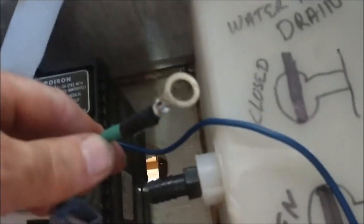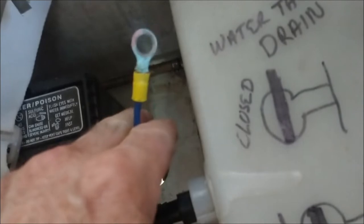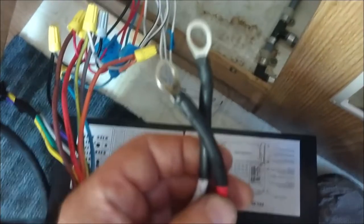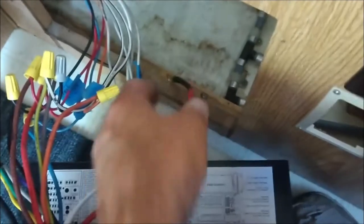I've got my ground cables ready to go - I soldered on some new ends. This one goes from the negative to the negative in the block. I've got my positive and negative battery cables with terminal ends soldered on - nice and tight, clean. I'm going to slide this back in now and figure out how to route my AC wires through the box.